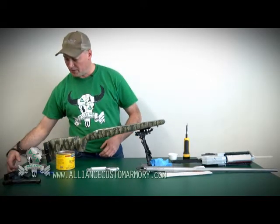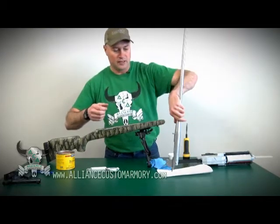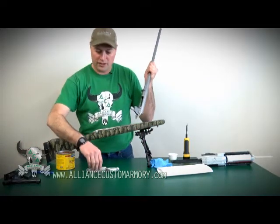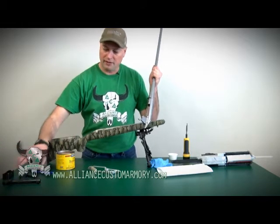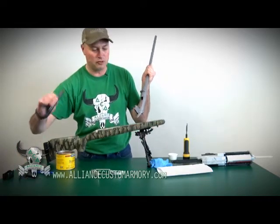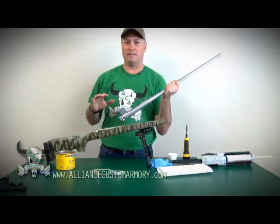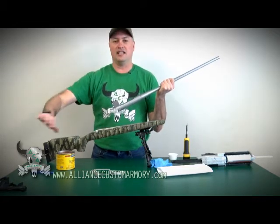So I'm going to go through the process here. Your packaging tape is used as a spacer, so what we're going to want to do is pull the rifle apart. Pull it out of the stock, and also you're going to want to remove the magazine box, the follower, and spring from your bottom metal so that when we glue this all together, that stuff is out of the way. Also, remove the bolt from your barreled action. You want to minimize the chances of epoxy getting into that and messing it up.